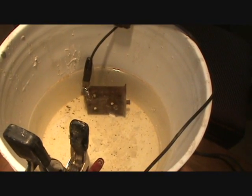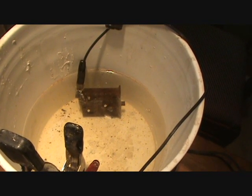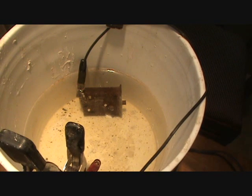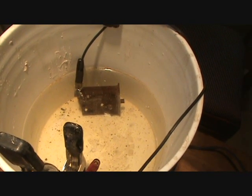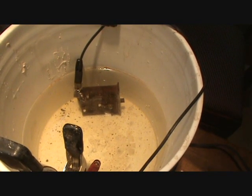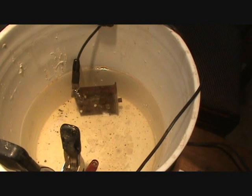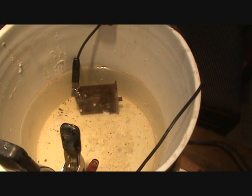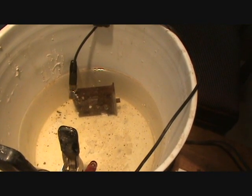This has been going about a half hour now, and there's still a long way to go — this is a pretty rusted piece. You can do this for as long as you need to: overnight, hours and hours. Some lightly rusted things will be cleaned up by now. A half hour would have been plenty for something with just light surface rust, and it will completely get rid of all traces of rust on your part, leaving only the bare metal.